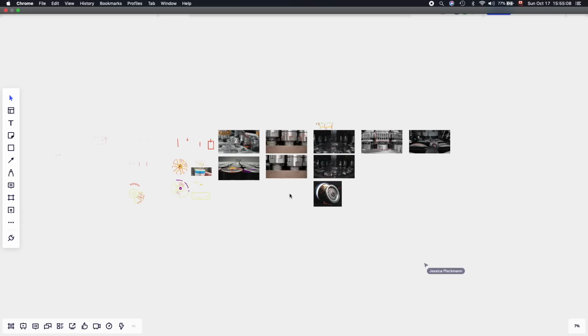And this is where that machine is not a problem, but there are engineering issues to be fixed as you're increasing the throughput. First of all, there are all these steps that I mentioned in between. Those steps have to follow. You can't have dissimilar throughputs, or else you have to build inventory buffers in the middle of this process. So when you're making the foil go faster, you're getting 16 rolls wound at the end of that process faster, which have to go to winding jelly rolls faster. And these jelly rolls have to get wound faster and then inserted into cans faster.